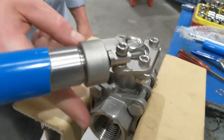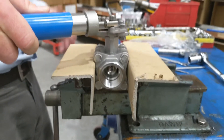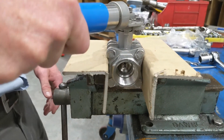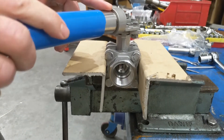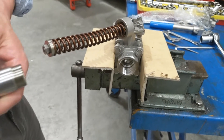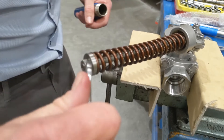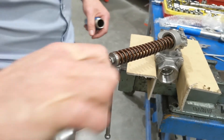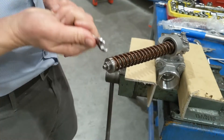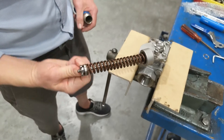You can see the valve is in its closed position. Let's test the handle — if I pull it back just a little bit, this is the point of lowest torque. When I let go it does close, but I'm going to tighten the spring bolt to give more spring pressure. If you take the handle off you'll see the spring retaining thread with a nut on the end — tightening this nut compresses the spring, shortening the distance the spring has to operate in, giving us more force.